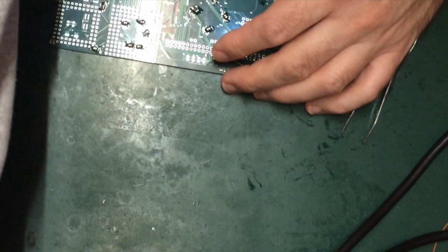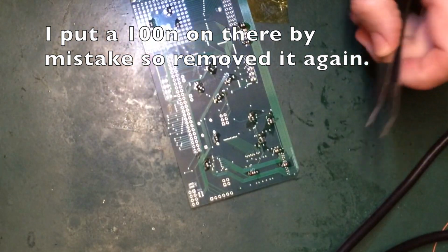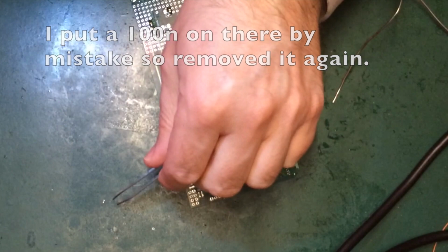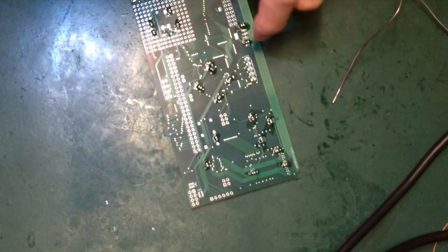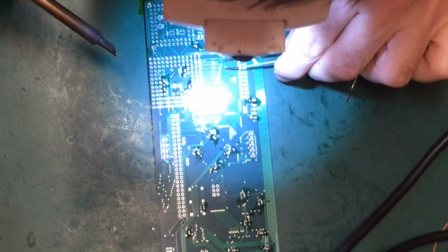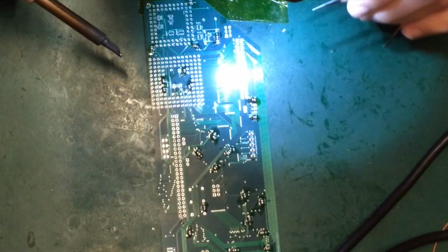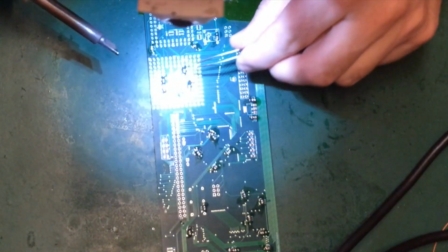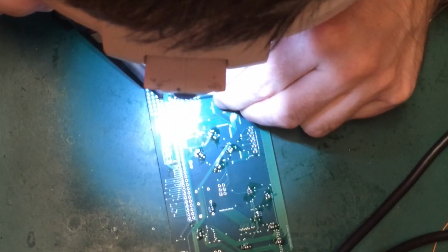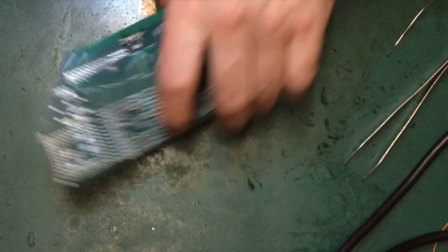Now this one's going to be slightly different because I've already got a bit of solder on the pad. I could wick it up and go from there, but I really don't think it's necessary. I should just be able to tack onto it and then snap it into place the same as before. But obviously it will start at a much higher angle. Well, tweezers get covered in flux, unfortunately. There we go, and then just snap it back into place as with the others.